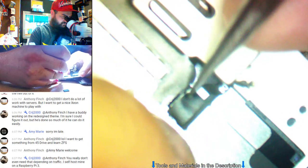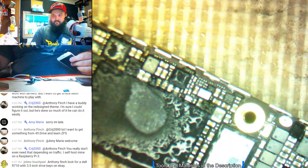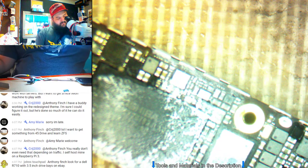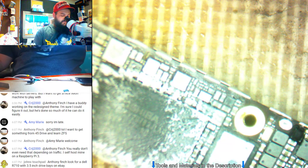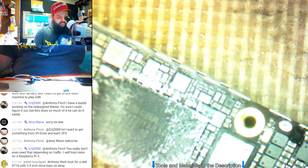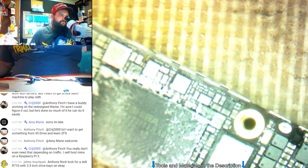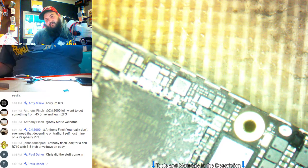That's not the screen I'm using. What about the other one? The other one's completely covered. I looked at it. That was the one I was going to use, but I guess I don't know. Well, we need to pull the shields on it and see why it has no backlight, or look at the filter. Where's the filter at? Right next to the connector. Yeah, so it just rebooted. Even freeze spraying the NAND, it rebooted.